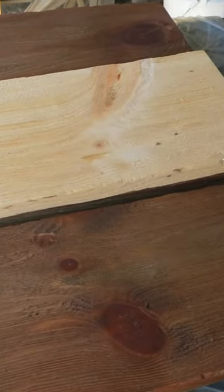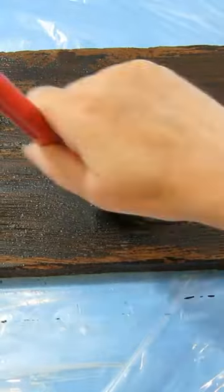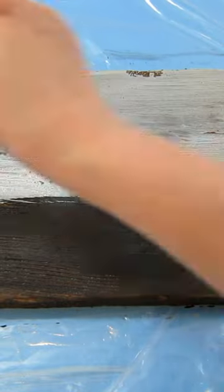See how it darkens? Now we're going to brush on some milk paint — this is coal black. Spread it on evenly and leave it for about 10 minutes. On top of that we're going to put another lighter colour; this is a limestone milk paint. Then we're going to wipe it back and expose some of the colour underneath.